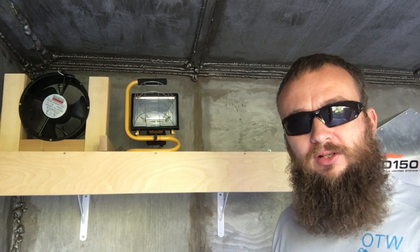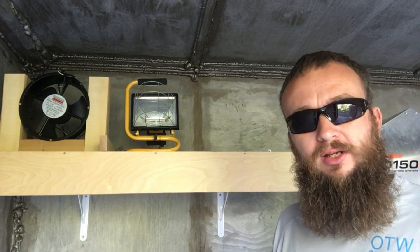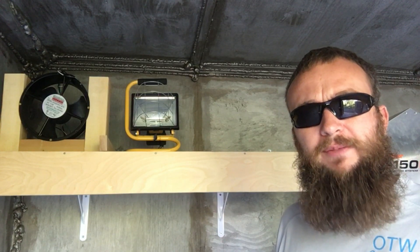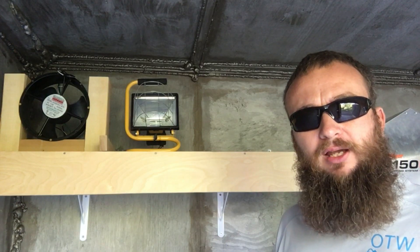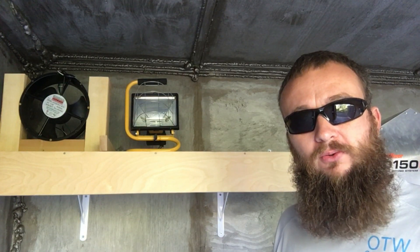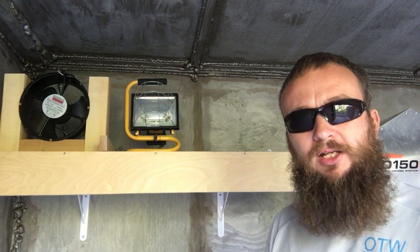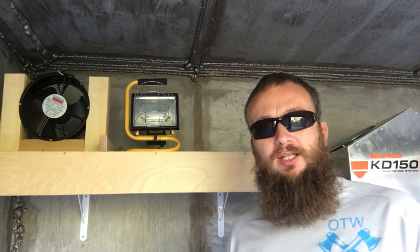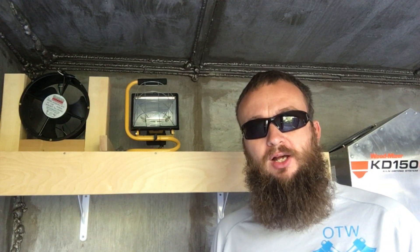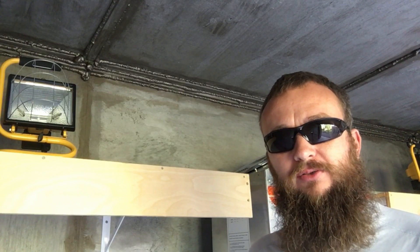The compressor kicks on faster because the kiln has to be at a certain temperature — 75 degrees on the wet bulb — before the compressor kicks on to start pulling the water out of the boards. Instead of maybe waiting 24 hours for the kiln to heat up to that temperature, using these lamps could in theory take maybe 12 hours, with a lot less electricity on heating up the kiln. Once you've reached that temperature and the compressor cuts on and you're drying your wood, you can cut these lights off — they will not stay on for the whole kiln cycle.